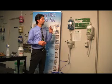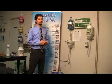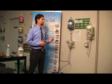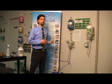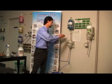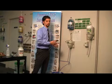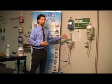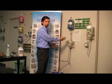Okay, next I'm going to talk about if you're not getting enough detergent and you're using either of our powder detergents. So that's going to be Superior or Energize. First thing you're going to want to do is to physically remove the detergent from your bowl and check the bowl to see if there's any debris. This could be a cap, it could be a screen, anything of that nature. You're going to make sure that that's removed so that the water can come through the screen cap and activate the product.